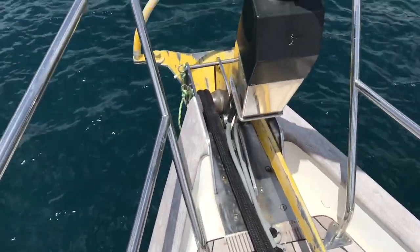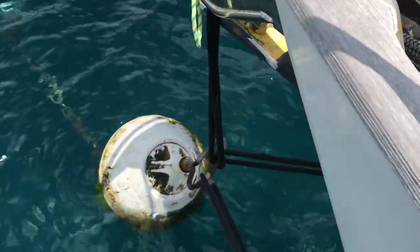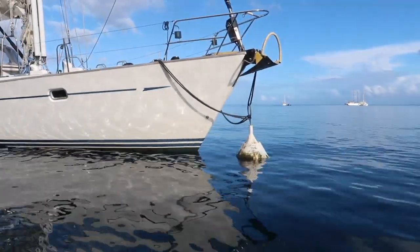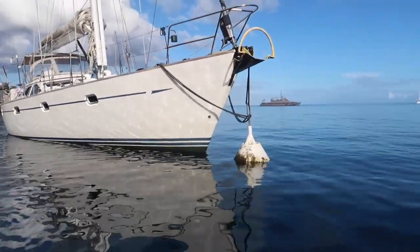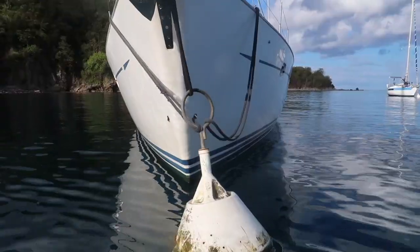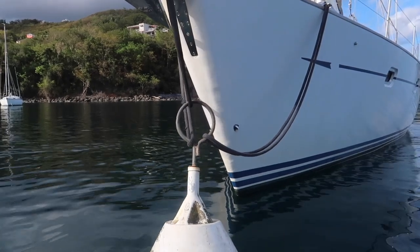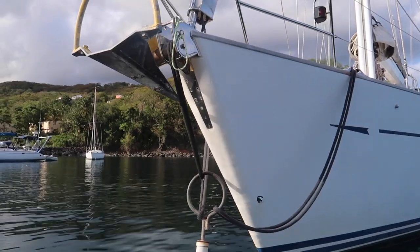Here's my little-known technique that will keep a mooring ball from hitting the side of your boat, making an annoying bumping sound and/or damaging the gel coat on your hull. You simply need to add another line that runs down through the anchor plate to the top of the mooring ball and back up. By adding this quick but effective extra line you'll sleep better at night and know that your hull isn't getting damaged. As a side note, it's usually during a no-wind situation that this is a concern — provided that it's windy, it's not a necessary step.